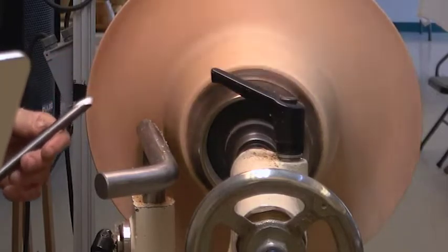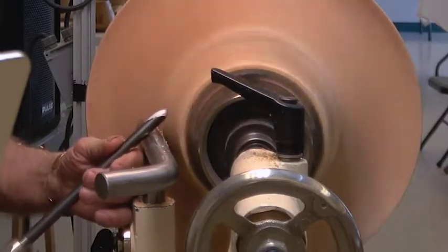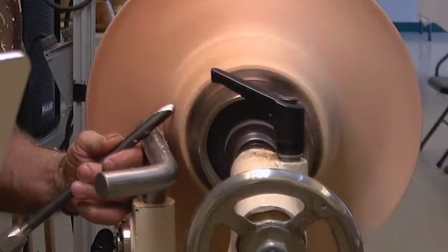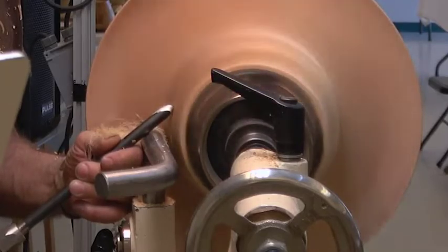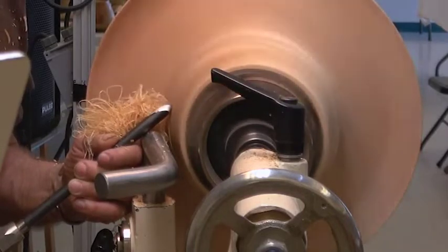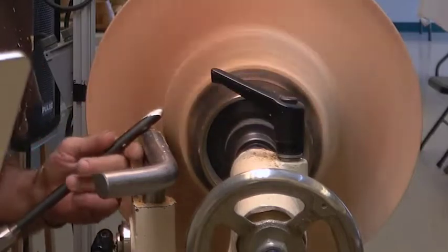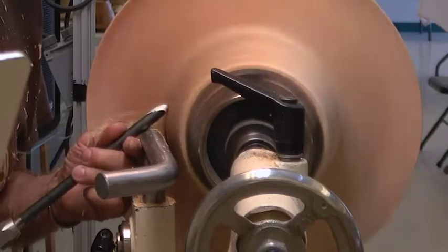So you have to take a deep breath first. And then you lower the handle on your leg, cut with a sharp part of the tool, and come in very lightly and get that cut to start without the tool bouncing on anything. You have to come in almost, you just float the bevel above the surface and go in for a cut, pick up that cut. And now I'm having to bend my left knee more so I can get that relief of edge of band that I'm after.